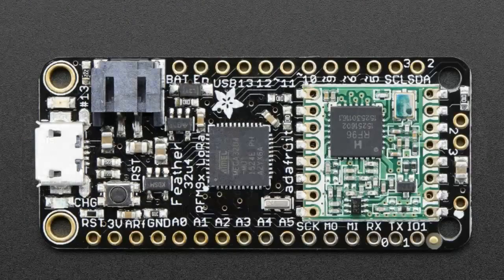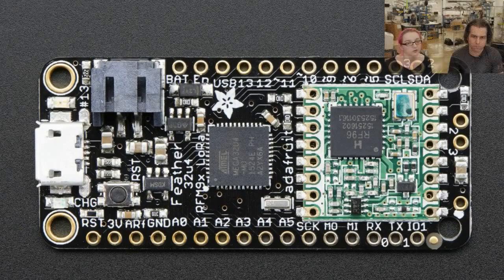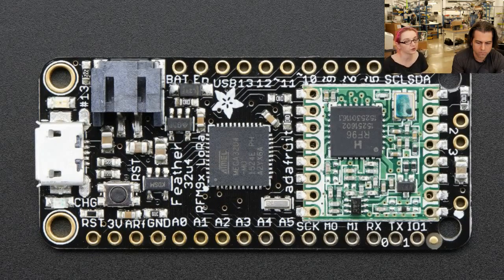They just add the analog components. This is a new kind of radio technology that uses spread spectrum — it sends data over multiple frequencies. The way they encode it allows it to go much, much further than most FSK data which just switches between two frequencies. We did a demo in Maryland with Todd and it worked with Adafruit IO — he went 1.2 miles. In city or hilly terrain it goes about one to one and a half miles with just a basic wire antenna. Using directional antennas and slower data rates, one person reported getting up to 20 kilometers.